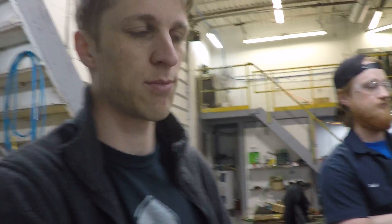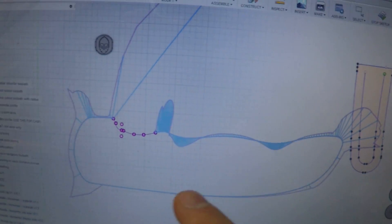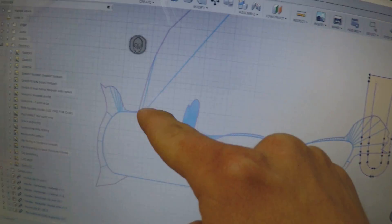The solution to avoid that — like I said, this design is literally four years old and it's gone through a couple different CAD programs. I'm using Fusion right now, and if I turn on curvature combs you can see: you don't mind the sweepiness, that's no big deal. It's when it goes jagged that it just turns to crap.